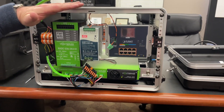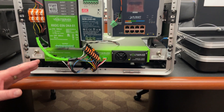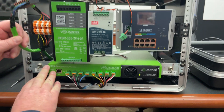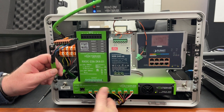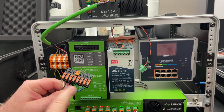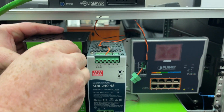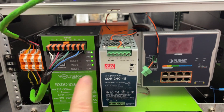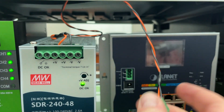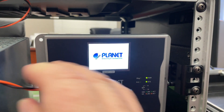I have the receiver and power supply installed on our DIN rail. We have our digital electricity transmitter with four wires connecting to the plug — all digital electricity on this plug. When I plug it in, this device will power up and immediately turn on the Mean Well power supply. We now have 48 volts DC on the end of this plug, which I'll plug into our switch, and you can see it power up.